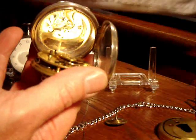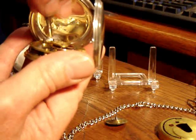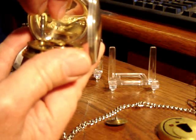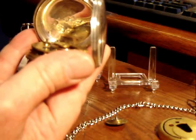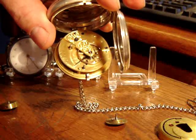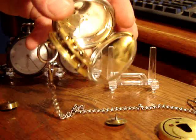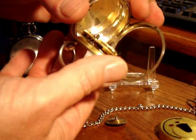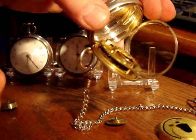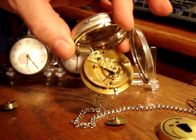All of the English watches — when you wind these, you wind them counterclockwise. I've wound this just a little bit, and you can see it took off running. This one hasn't been run in several months, so it's in pretty good shape. When I got this one, the mainspring was broken and the chain was missing. I had to put a mainspring in it, had to modify the barrel to get it to work, and install the chain. Anyway, this is a nice example of a lever type Fusee watch.